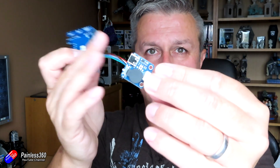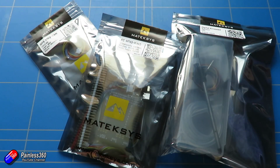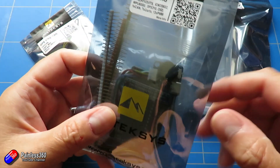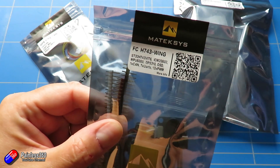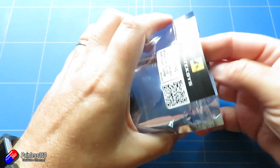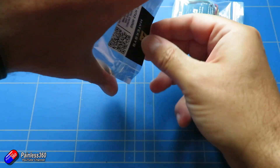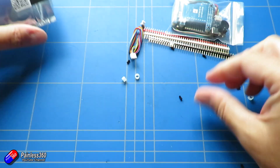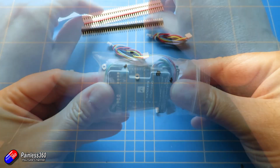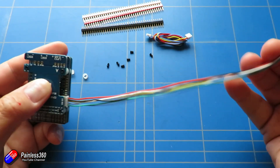Let me unpack these and talk about the specs, because you've probably noticed the USB port is in a slightly odd place - there are quite a few cool odd things on here too. Taking the new H743 Wing out of the bag - be really careful when you take things out. You're going to have to install the pins; they don't come pre-installed. You have a spare set of spacers and screws to put the top board into place. Just like the F765 and F722, the top board is also part of the voltage regulation, so you will have to do a little extra soldering on that top board as well.